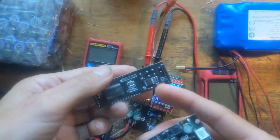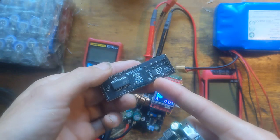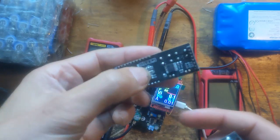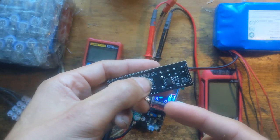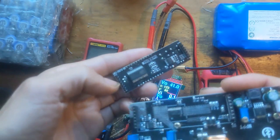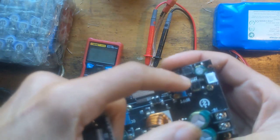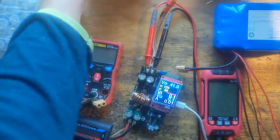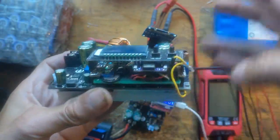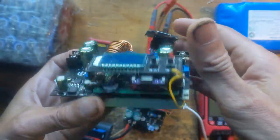This chip does not have a digital DAC, but it can make a PWM signal and then filter it. Here these little things — it looks like a low-pass but it's not really. Then it's a one-megaohm going to this pin, I think the third, which goes to this potentiometer. I also made an MPPT charger here with a little OLED display.